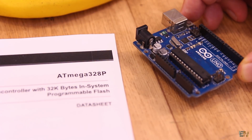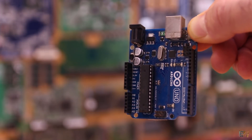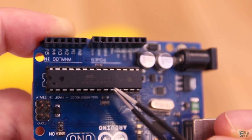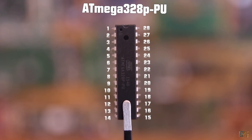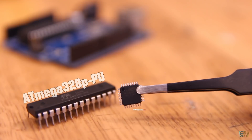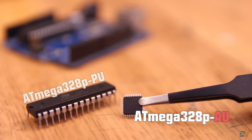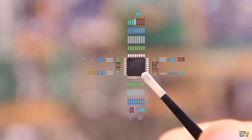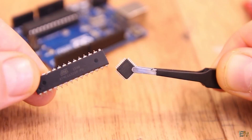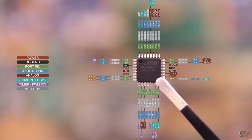Welcome back. This is the Arduino Uno that I will use for today's examples. This board uses the Atmega 328P PU microcontroller. This IC has 28 pins and a DIP package. We also have basically the same microcontroller in an SMD format — the Atmega 328P AU version — which has an SMD package and 32 pins. As for memory and everything else, these ICs are basically the same, but the SMD version has 2 more ADC pins and 1 more ground and VCC pin.